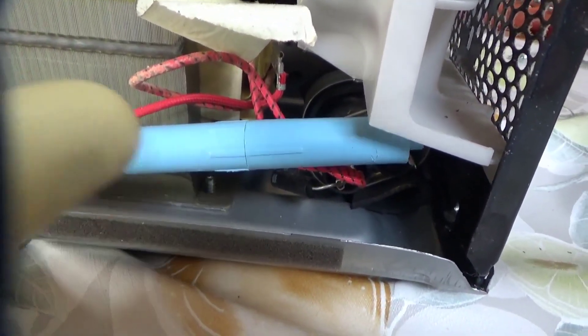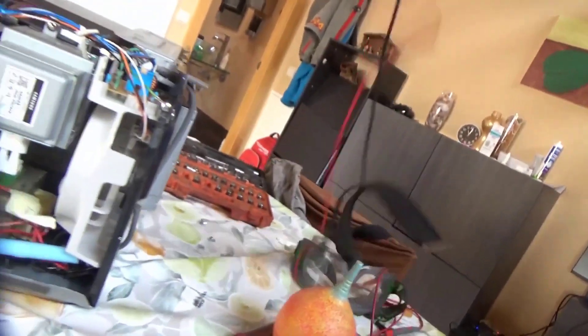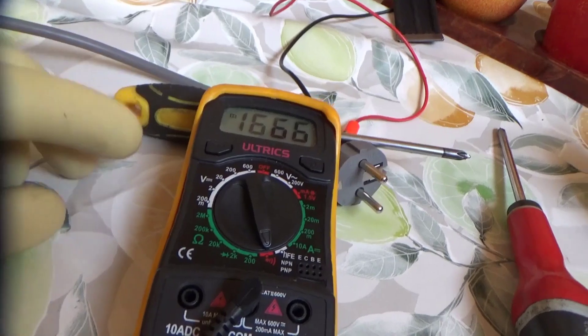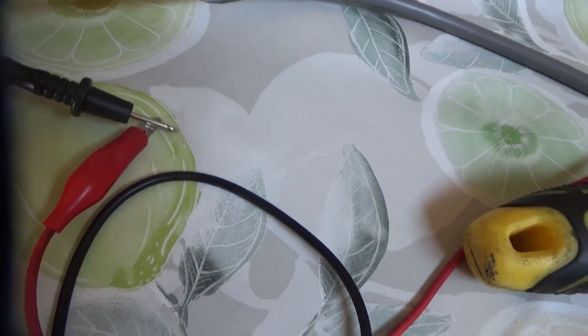What I'm going to do is with a multimeter, check continuity at one end and the other end of the fuse without disassembling it. If it gives me continuity, it's not the fuse. If it doesn't give me continuity, it's the fuse. I'm going to put it on the continuity scale, which is the one that has the little symbol in red. You put the probe on one side and the probe on the other side — if it beeps, it has continuity. If it beeps, it means the fuse is okay. The multimeter works, so we're going to do the continuity test on the fuse.